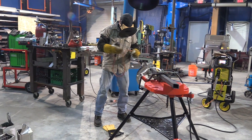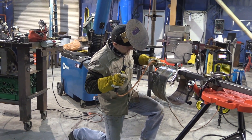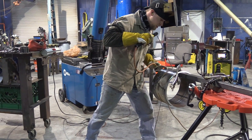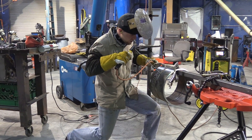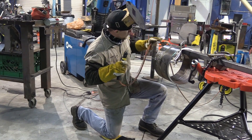So you've got to move your body and maintain a good line of sight at the same time. So that was the root pass — I will link up the root pass video right here. This is just a little review on body positioning. It starts with grabbing that stinger, that whip, which is a light-gauge super-flex cable whip, grabbing it so that it won't hang on anything, and then making a few dry runs and knowing what you're going to do before you do it on body positioning.